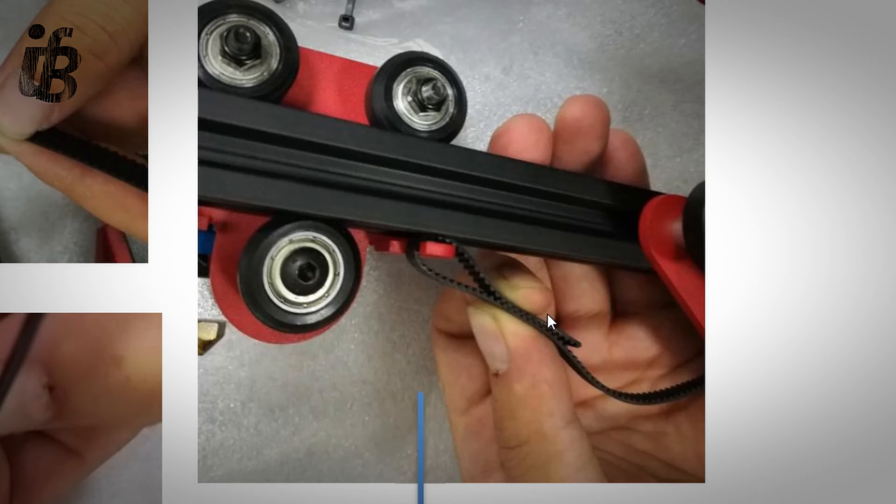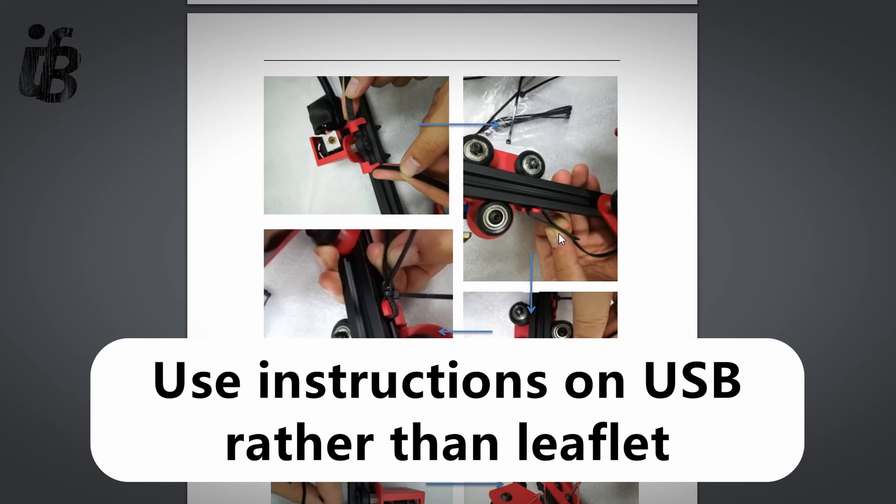Though SandTube 3D did say that you can put the belt on any way you like, but I felt he kind of put it on the wrong way around, purely because the two smooth sides together when you put a zip tie around it may allow for some slippage. But if you put it so the two teeth interlink together and then put the zip tie around it, this should help prevent the belt from slipping. The links for these videos are down in the description, but yes, I totally agree that the instructions are not that great. Luckily I checked all my parts and there was nothing that was bent in the box — with the amount of packaging it came in, I wouldn't have expected it to be either.